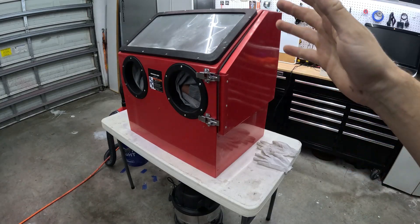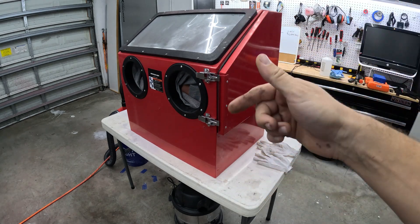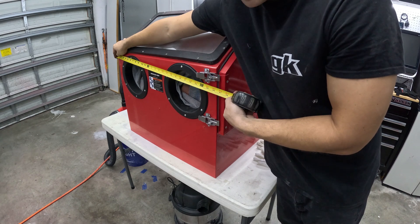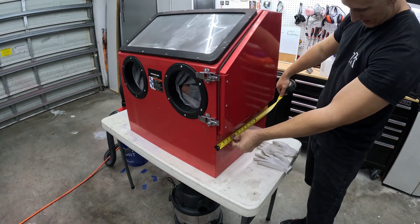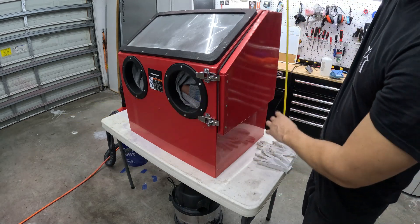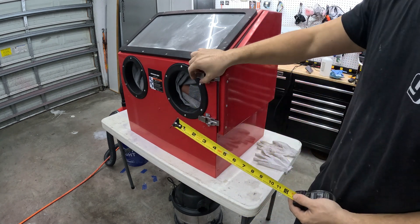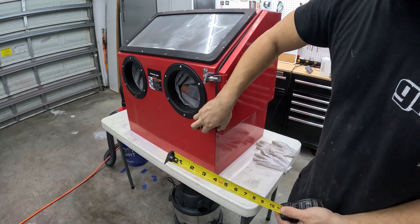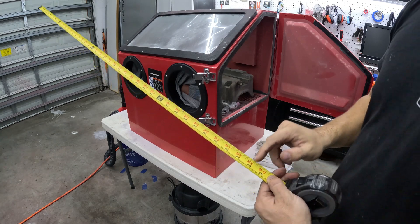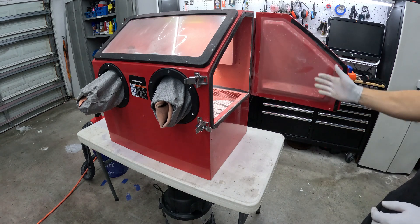The overall dimensions for this unit, which I picked up off a marketplace — I've got links in the description for a very similar unit. Length across the front is 28 inches, width is about 18 inches, and max height is also 28 inches. We do want to account for this door and how much room you need to have open. With the door open, we're coming in at about 45 inches. This is a side-load unit, so the door is going to have to open and you'll need enough space for that.